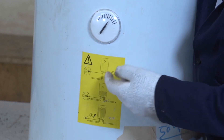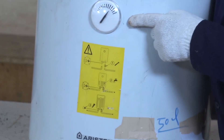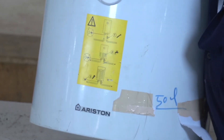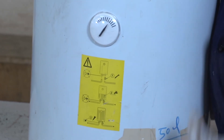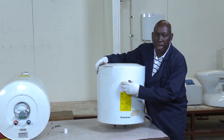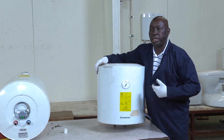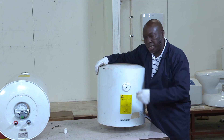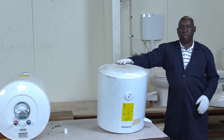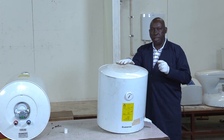Finally, you can see we have a gauge here, which is automatically connected to the thermostat. It indicates the temperature for you, because you will not be constantly checking the thermostat — remember, when we fix it, the thermostat is underneath. This gauge is for you to see and monitor the temperature of water in your cylinder. It will allow you to give it more time to heat, or decide if the heating temperature is enough and you can now use the water. Basically, that is the construction and makeup of hot water cylinders, and that is the function of a hot water cylinder.